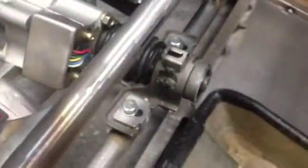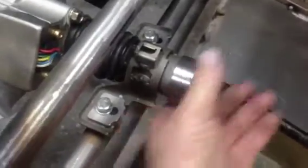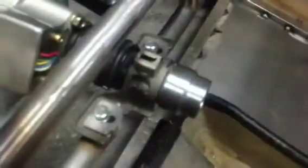Worm and worm gear. But technically it still needs a bearing at the front here. So what I've done is I took this back to where it needs to be and turned a new piece to go on the front. This diameter here sits on there so she sits nicely on the front. Inside here I've turned this down to 33mm - bored it at 33mm - and basically put a needle roller bearing in there. It has a 33mm OD and a 25mm ID.